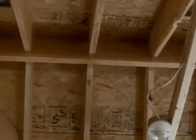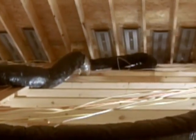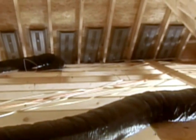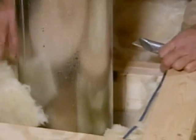Whether using a professional or doing it yourself, the first step to insulating your attic is proper preparation. Air leakage at framed areas, such as where inner and outer walls meet attic floors, dropped soffits, and behind or under attic knee walls, are most likely to have large holes that should be plugged and sealed for maximum energy savings before adding insulation.